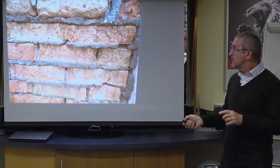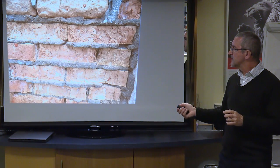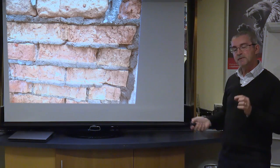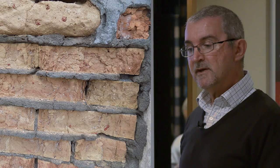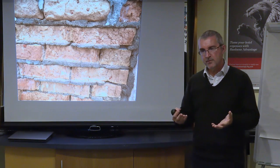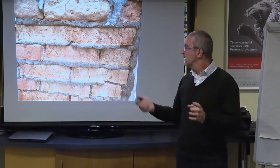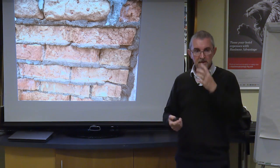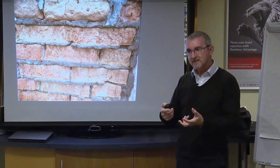Here, I wanted to show you this. I'm doing some research on Venice, and I went to Venice a couple of weeks ago and I took a whole series of pictures, and I wanted to show you this because you'll never in your working career come across this type of cement because you can't buy it in the UK. This is a Portland cement, but in Venice they call it a pozzolanic Portland cement. So I explained earlier that the Romans had identified that putting pozzolanas and PFA into their non-hydraulic limes makes it go strong. Lafarge Tarmac, who are a major manufacturer of cement, have been developing this cement for use in the Mediterranean countries. So this is a Portland cement, but with pozzolanics in it to make it really, really hard.